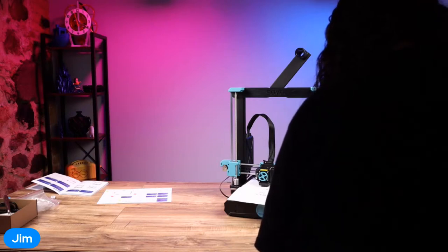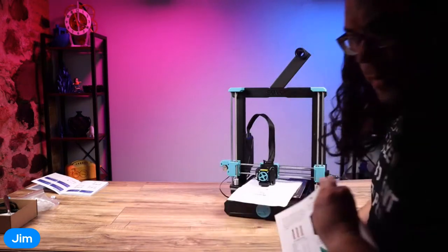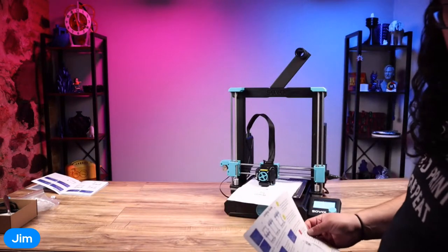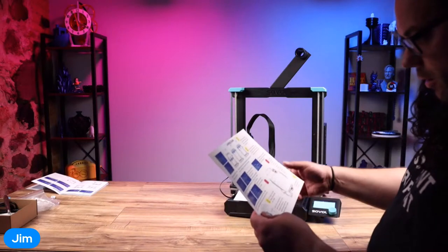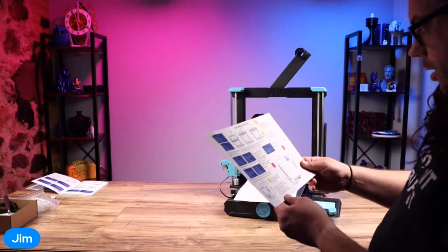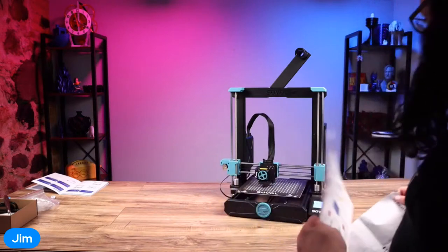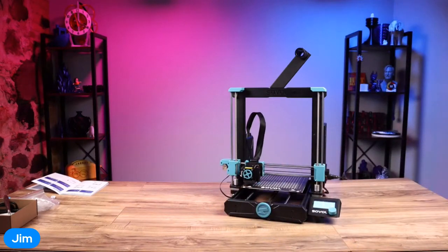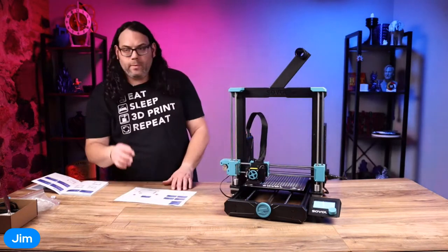And I'm going to store settings, I believe. Okay, I did the store settings with the Z offset. Hopefully I did that correctly. Should be good there. It says, don't forget to save settings after doing your Z adjust. Great. So then click level bed. So I'm going to pull this out, and we should do a bed leveling now. And we're going to see how fast this rock and rolls through the bed leveling.